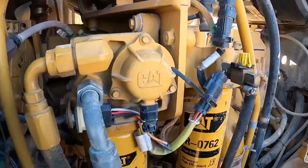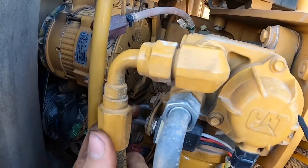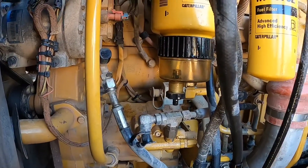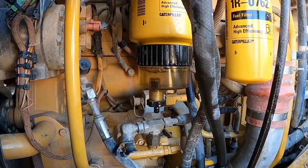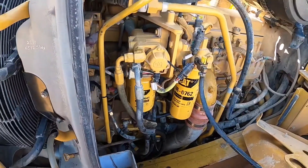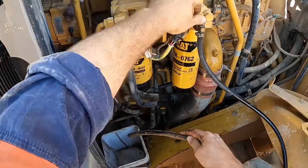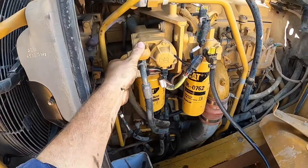This little plastic tap is what you use to bleed this area of the fuel system, and this little toggle switch starts the electric pump. Turn the yellow tap towards the hose and start your electric pump up. This fuel system is super easy to bleed — you can see the fuel coming through already. Just run it until you see fuel coming out of the hose. This is a manual prime pump only, not a lift pump for the main fuel pump. If you have the key on or the engine running, the fuel pump won't work. Once fuel is bleeding through, shut your tap off and start the little pump up — you'll hear it load up, and that's when you know she's primed and ready to go.